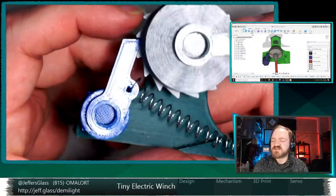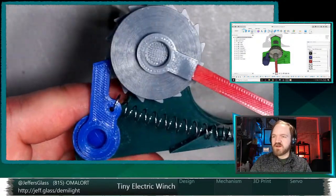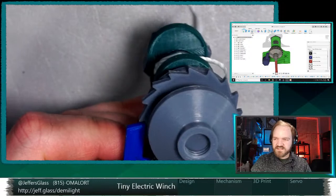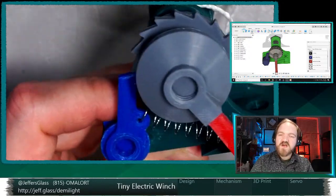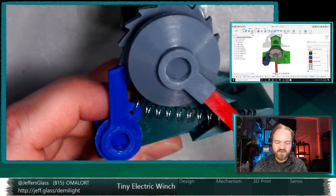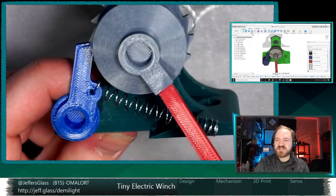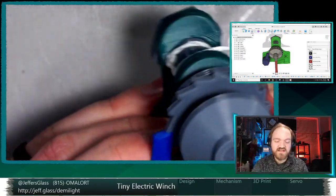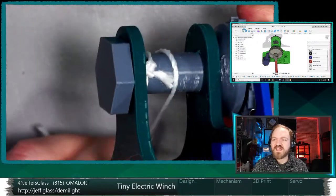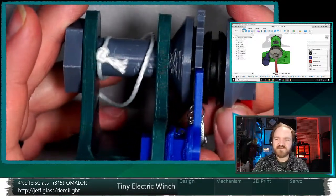In some sense, we could have this ratchet go in either direction. Now we have the ratchet turning clockwise, but not counterclockwise. And that means that in this case, our up direction is clockwise. It winds tight, it doesn't wind back down. And you can think, well, clockwise, counterclockwise doesn't really matter. We could pick either of them arbitrarily. It would ratchet in one direction and not in the other. And so I designed it to ratchet counterclockwise to start with, and then discovered that there was an issue with that. And the issue has to do with how this winch design handles going in the down direction. How are we going to get this thing, which has once gone up, to come down?